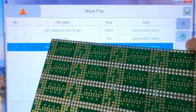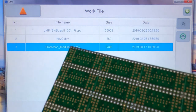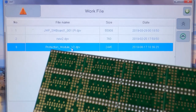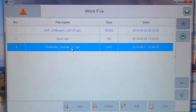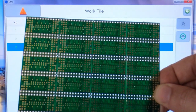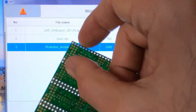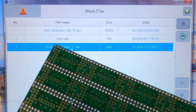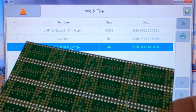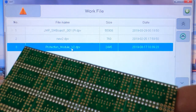I've been asked to look at panelizing a single board from a PCB CAD system. Once you've got your PCB designed, you're going to have to have it manufactured. At that point, you have to decide whether you're going to duplicate it on your CAD system so the manufacturer just makes what amounts to a single board, or whether you're going to provide the PCB manufacturer with the design of just a single board and they will then panelize it into a larger panel. You also need to consider whether you want a solder stencil made up.